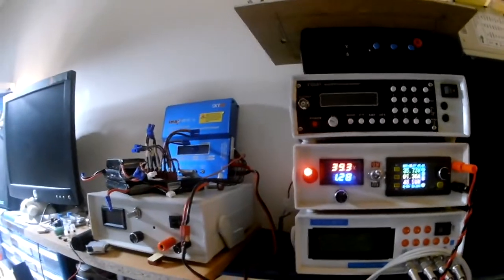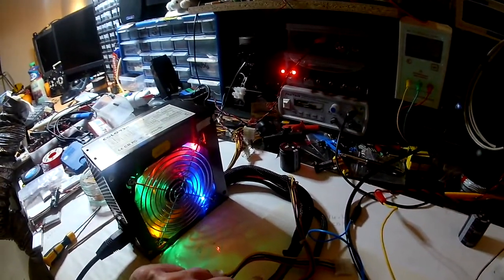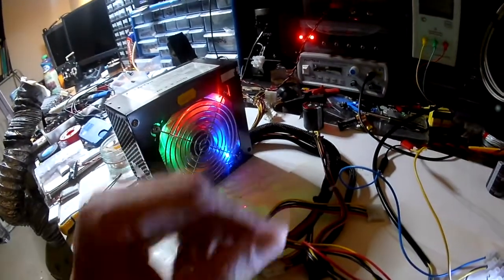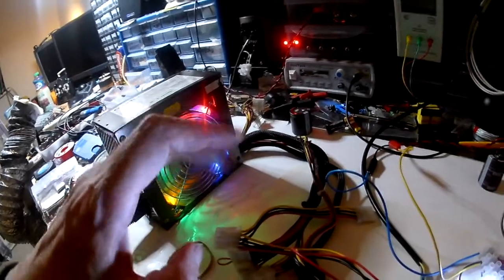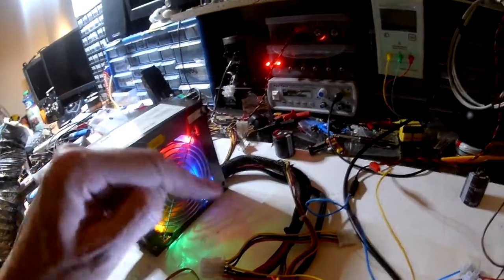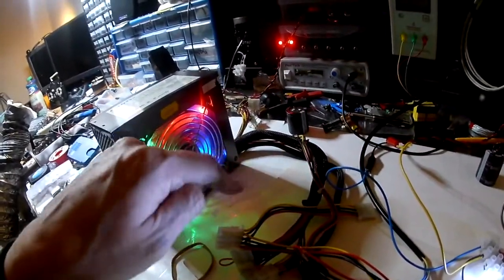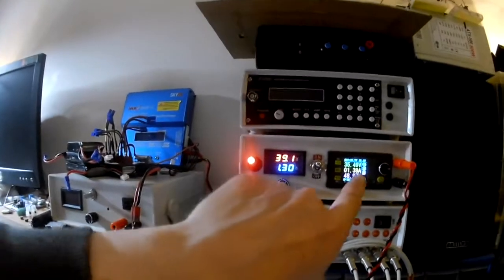He's pulling that down over there, look, so I've got a funny feeling it's probably down to this, isn't it? Because I've already got this on one wire here, do I reckon I need to connect some more of these wires together so I've got more current coming out? It's more than one line coming out here, isn't it? And I've got individual protections on, so I've got a funny feeling that's what it is. It's going to be this holding it back. I need to get more of these yellow cables hooked up together so they're in parallel. Then I'll have more feed in the boost converter because it's dropping down so much over there, which will give me more over here.